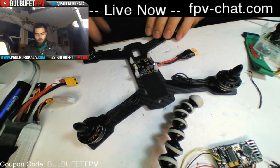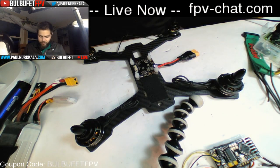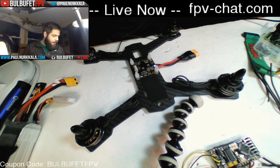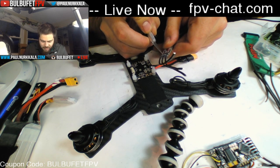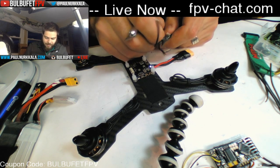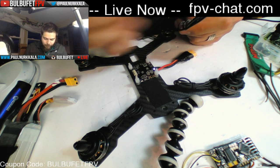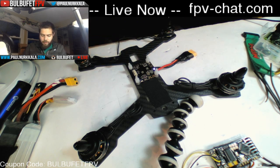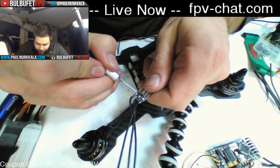Okay, so the way that I do electronics is direct soldering everything. You're just fine to use pin headers. They will not cause any performance decrease, except maybe a slight amount of weight. But I find that direct soldering is more maintainable, even though you have to desolder things to get them back off if you break something, just because it's more fire and forget. You can just do it once and then never have to worry about it ever again. You don't have to think about it anymore.